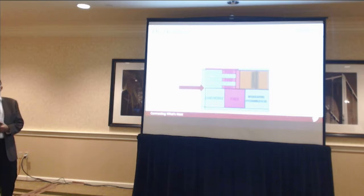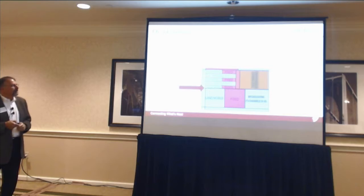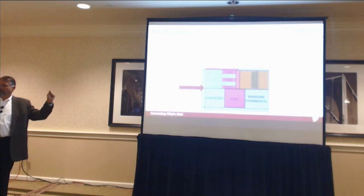Channel 14 was avoided like the plague — people that were assigned channel 14 got moved off. But when you reduce the spectrum, there are winners and losers. There were 20 full power assignments on channel 14 before repack; 8 of them won the lottery and got repacked off. But 12 remain on channel 14 and there are 30 new assignments to channel 14. The difficulty is the RF filtering required at the output of the transmitter to protect land mobile radio receivers — the burden is on the television broadcaster.